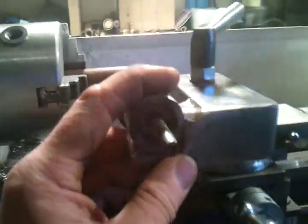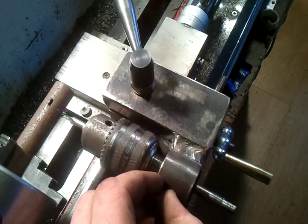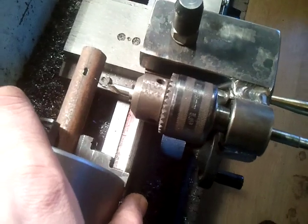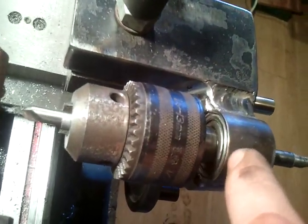The first part I had to make was this piece here — the bearing housing. It started off as a piece of one-inch heavy wall steel pipe, like this piece here. I got the spindle off an old drill, along with the bearings. Luckily I had two of the very same size bearings. There are actually two bearings mounted inside there. I measured up the piece I wanted, cut it, turned it nice and square on the lathe, and then had to bore out the centre of the pipe to take the bearings, because the bearings were bigger than the hole inside the pipe.